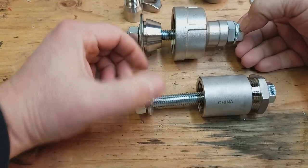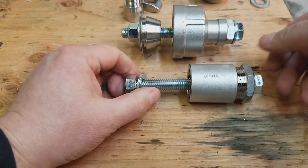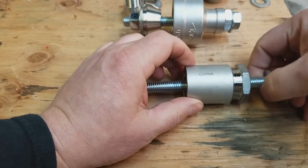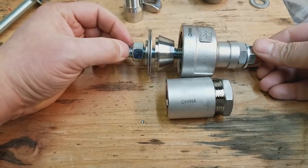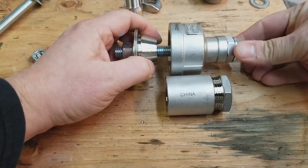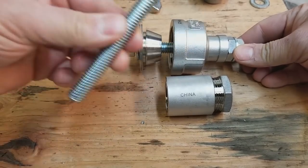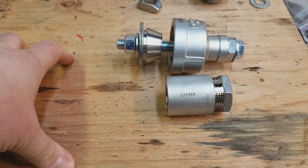This is available as a standalone pull-through tool for TC, as is the half-inch pull-through tool. However, because you might be building a pot and need both TC and MPT parts, we also offer it as a combo tool, which basically just shares the center bolt and hardware. What you end up with is this package here if you buy the combo — the only thing you change out is the cup die. You'll still need TC flanges and pull-through bulkhead fittings, but on the tool side we save money on the hardened hardware.